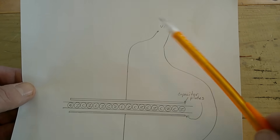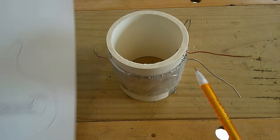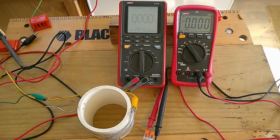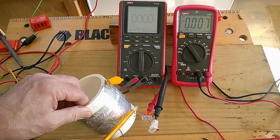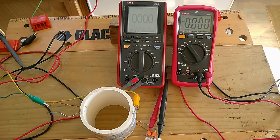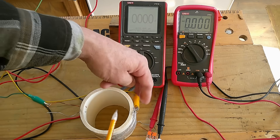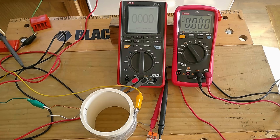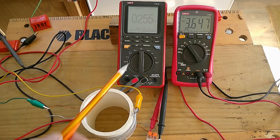For the experiment, I'm just going to plug this into the wall to get AC voltage to set up the alternating electric fields, and then we'll take a reading across the windings here to see what we're picking up. I have the experiment all set up and ready to go. I've got the voltage meters — AC — across our zinc and copper windings on one end, and I also have the amp meter set up to test the current through the capacitor's two aluminum layer plates. All I have to do is plug this in and take some readings.